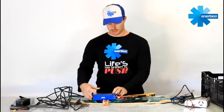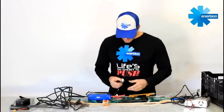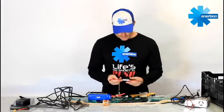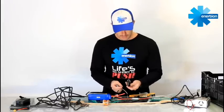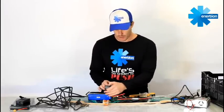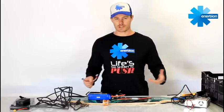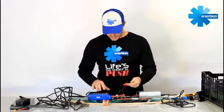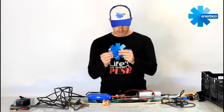Let's give you an idea of how you'd mock all this up on the board. Where would you put them? Maybe like that. They're pretty massive fat batteries so you'd probably have to put them side by side. Then you'd have to connect these up somehow, running into the high amp switch. And you'd need a panel somewhere to mount all this stuff — the on/off switch and your voltage meter — some sort of aluminium or whatever case you've made. That would have to mount on there. And when you want to charge your board, you have to connect these to the battery and the discharge cables. If you've ever tried to mount this on your case, it's really difficult.